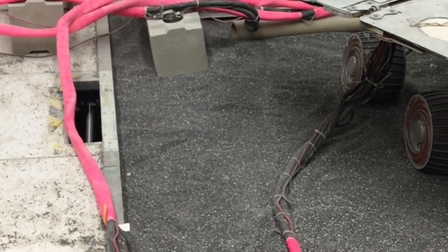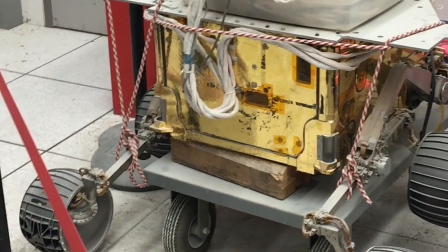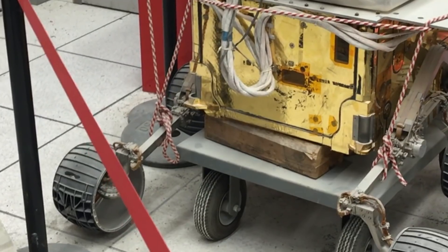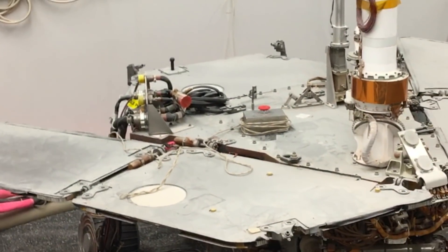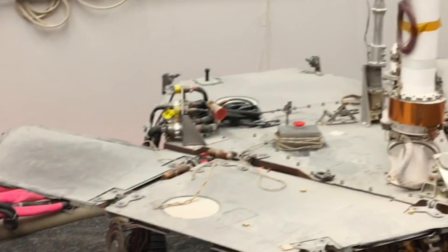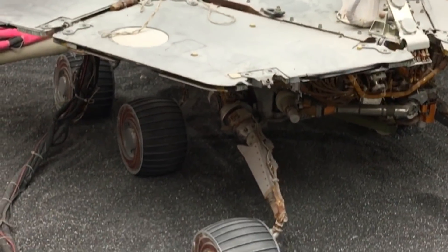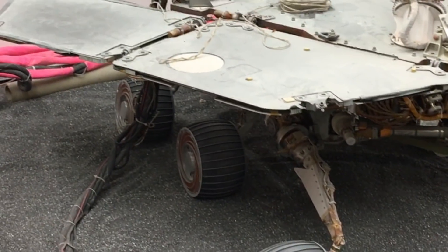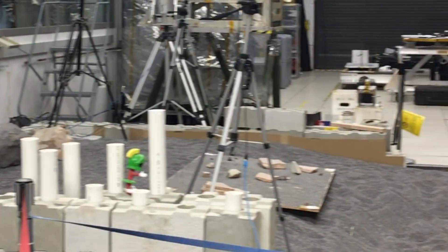You can see all the instruments tucked up under the arm. This one we drive with a box of buttons — a super low-fidelity driving simulator. That one is where you actually work the arm and write actual sequences and execute them on the vehicle. There's a big red stop button — that's the kill switch. If the rover is doing anything, somebody has their hand ready on it. If it starts driving into a wall or the robotic arm is going to hit itself, you hit the kill switch. The circuitry for the kill switch is on the real rover as well.